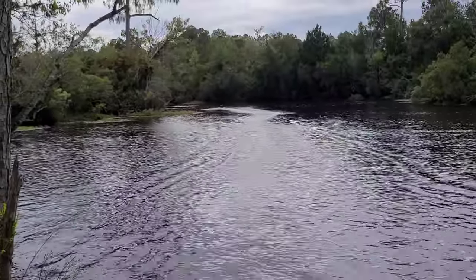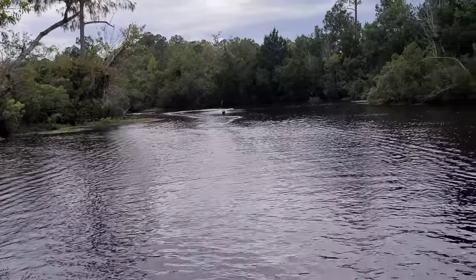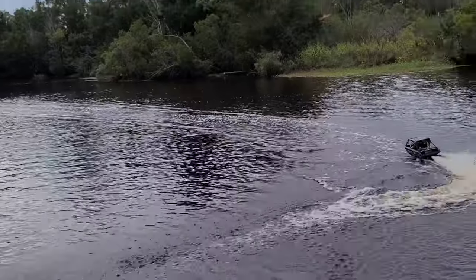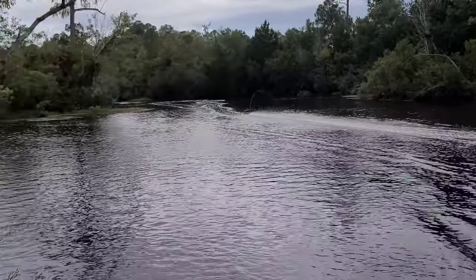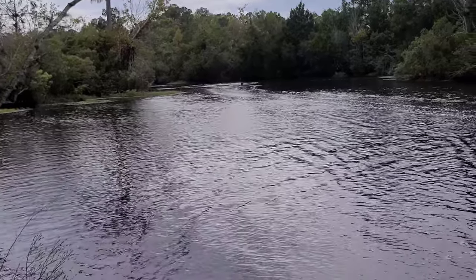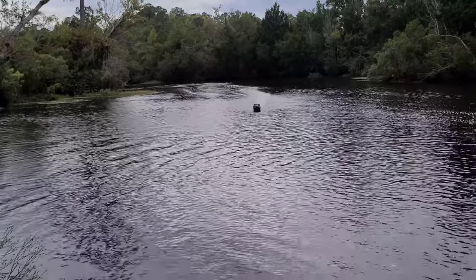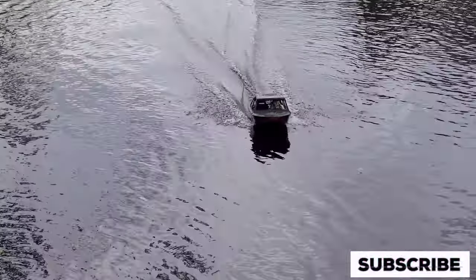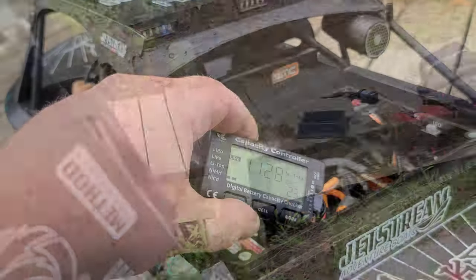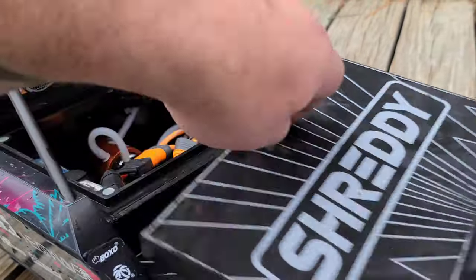These SMC batteries, they discharge like a full discharge, the whole battery, you know. So you really don't get voltage dropping off with these packs. Pretty quick. All right, so we're actually at low voltage. Got an LVC shutoff here, you know, it's at LVC. On this ESC, I've got it set for 3.4. 376, 375. Okay. So let's see what we did on 6S there.